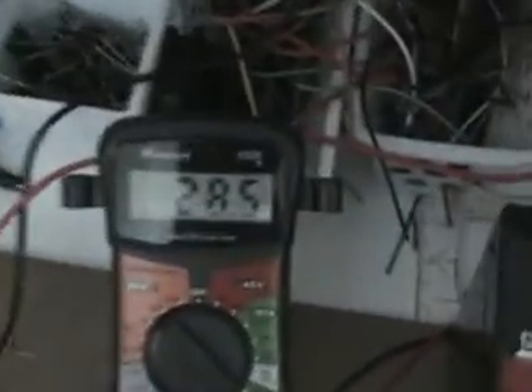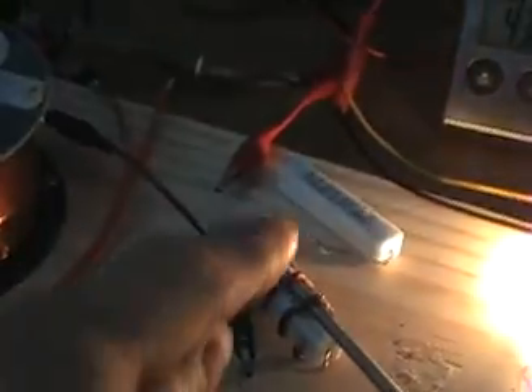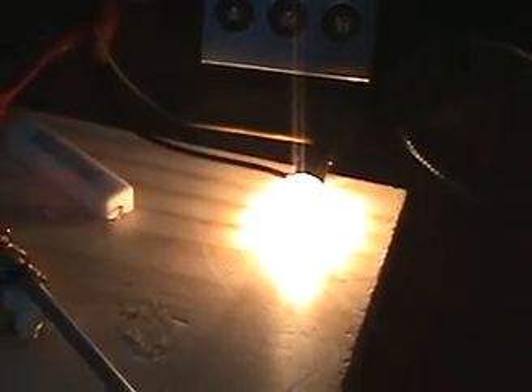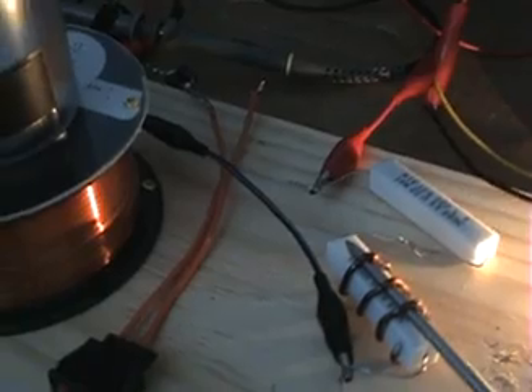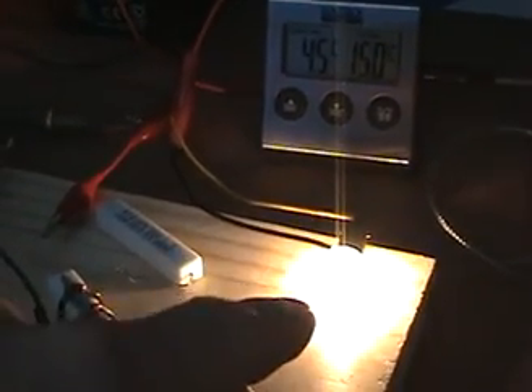That's the same elevation and we're at 28.4 volts, and that light bulb is totally bright. There's no way we can have that much of a difference. That light bulb is just a 12-volt car parking light — it's very fine, and it's definitely at its brightest, probably even too high. Right now the resistors are starting to heat up, but obviously we are putting much more energy in to get that work out of the coil. To me that is clear enough that this circuit is possibly indicating more work output when in pulse mode than in straight DC. I'll be doing another test utilizing resistors.